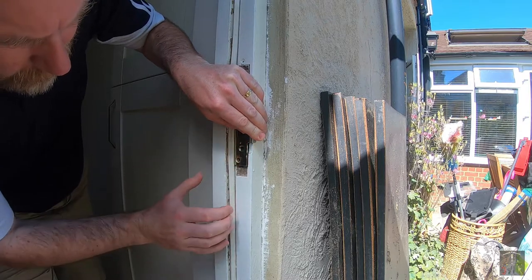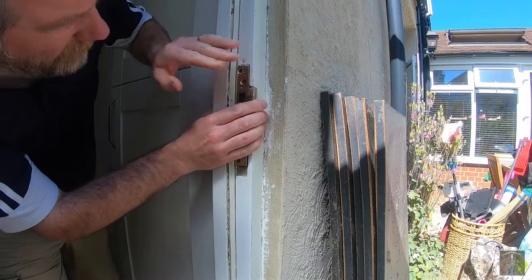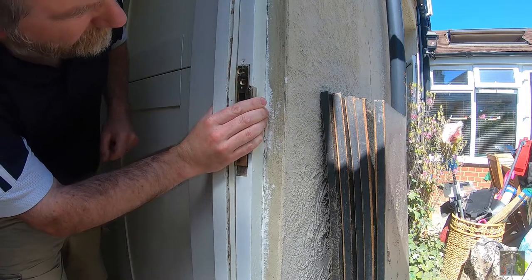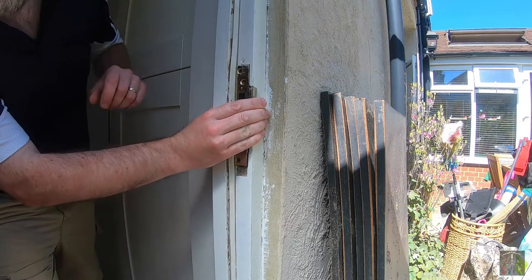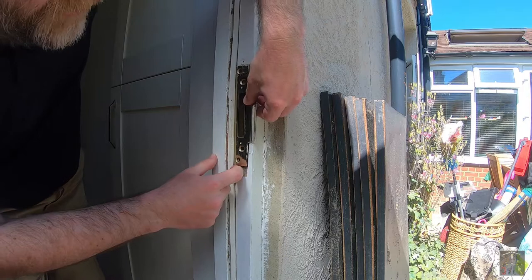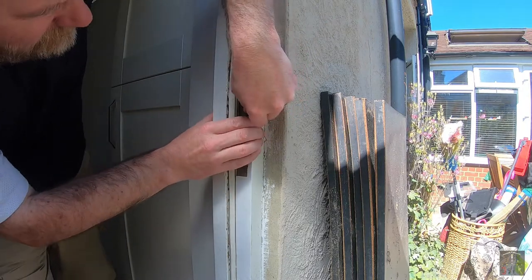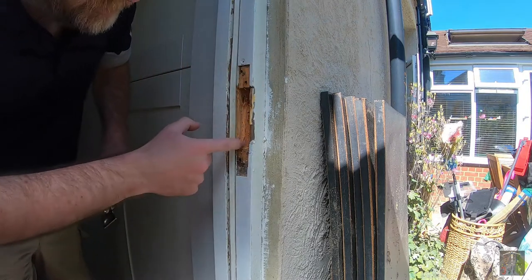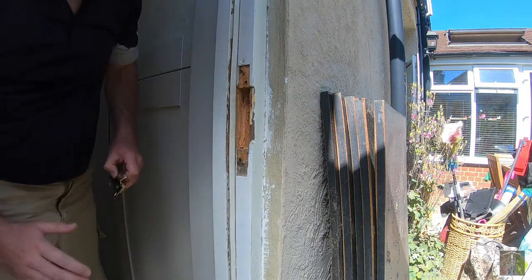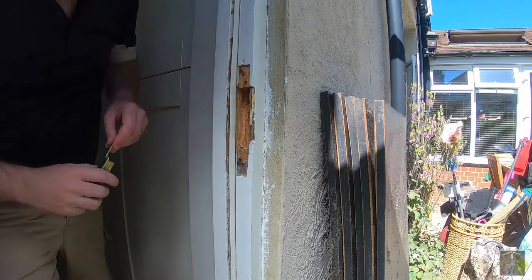Okay, so we're definitely on the draft proofing but I think that's a few millimeters back. I'm not sure we can do too much more without actually taking off the draft proofing, which I don't really want to do. So I think if we just trim perhaps a little bit more here, make it a little bit more even, and take the bit off here — because at the moment the plate is just riding up a bit — I think that will help.